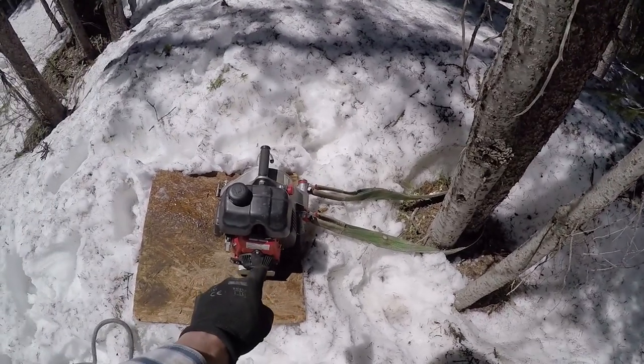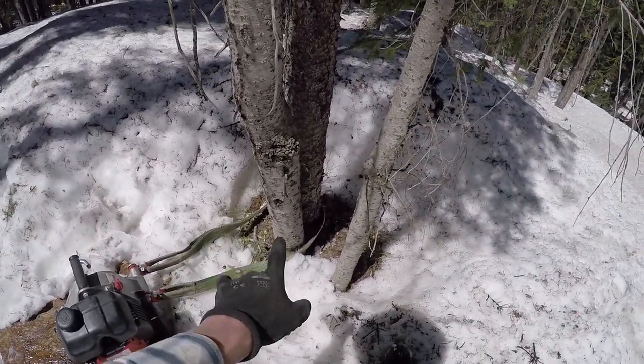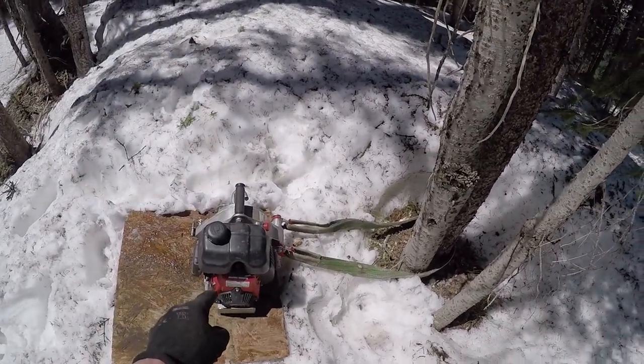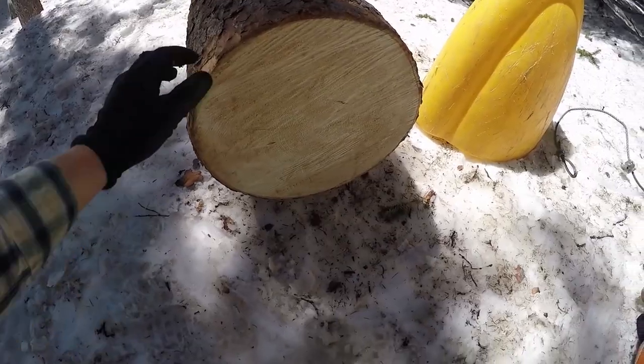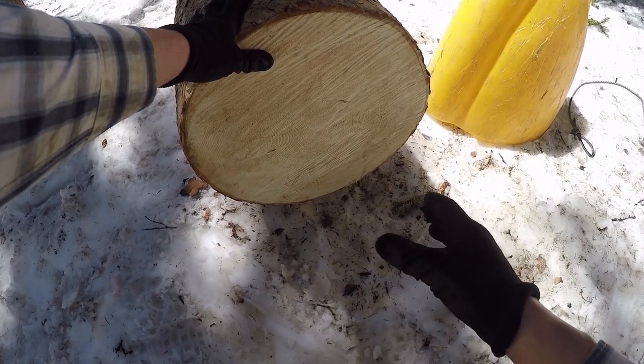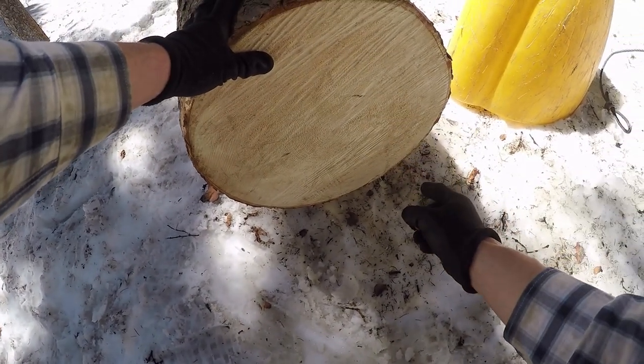The first thing I do when I use this winch is try to find a good pick point. I try to find nice, good living trees because we are going to be putting a lot of force on this winch and pick point. Next, I come over to the pulling end of the tree. Now, an important concept to understand is how this front end of the tree is going to move across the ground.